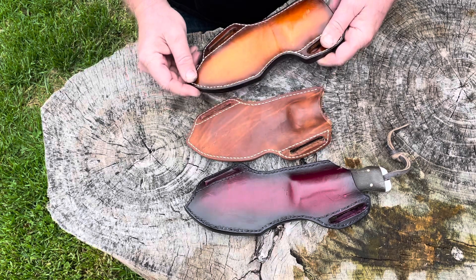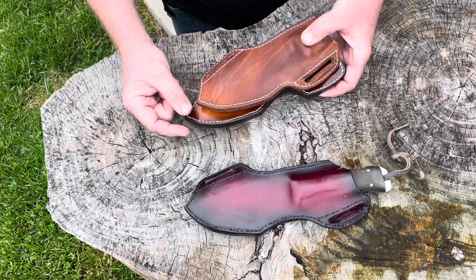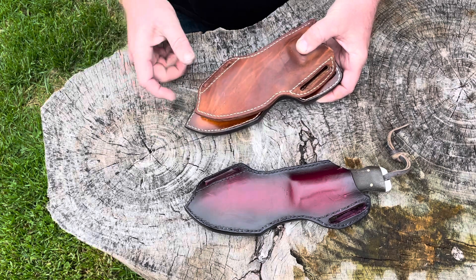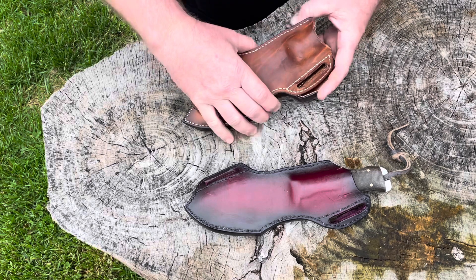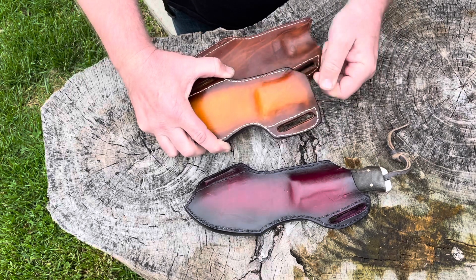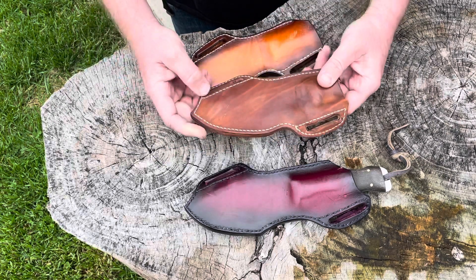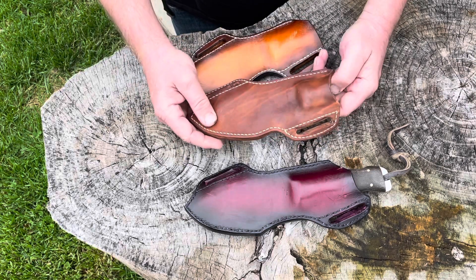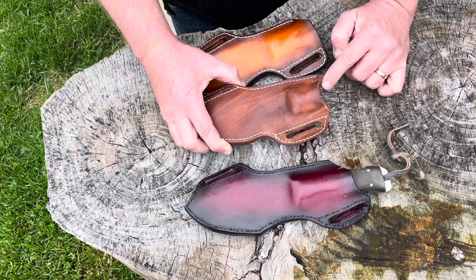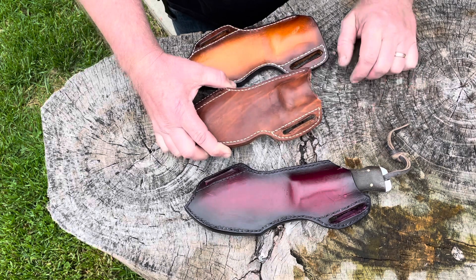That brought the whole knife up. You can see with this design that it brought the knife up maybe half an inch, which allowed me to get clearance when I sat down. The other thing I found from the first design was I was having trouble resheathing it because I just didn't have a good mold or a good opening on it. So with the second design, to save time, I didn't do any staining — I just coated it with beeswax. By putting the notch in the sheath where the handle goes, it allowed the knife to easily find its way in and resheathe without looking at it.